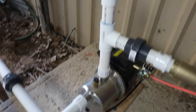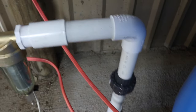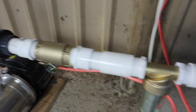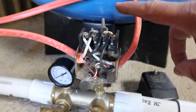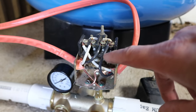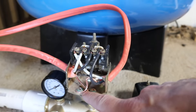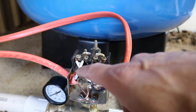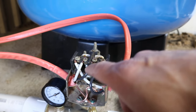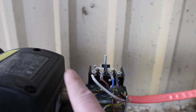Down here we're wired into our tank pump. We've got our line in from our panel, and since it is 230/240V we've got hot one and hot two to the outside screws on the top, and our ground to the bottom — no neutral needed in this case. Matching the wires: whites on this side and blacks on this side. This is our power out on these two to our other pressure switch on the jet pump, and those go outside to outside in the same configuration. Then these are per manufacturer specs to power the pump.